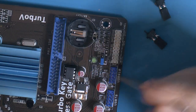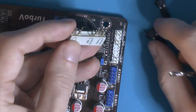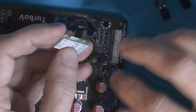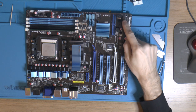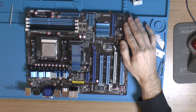It does turn on, so you have a power LED here, so you can turn the power supply on via the motherboard. You can touch the power and ground and it will turn on the power supply and then everything else, but there is absolutely no life on the computer. I have put a postcard in it. What I initially did was troubleshoot this area and trace other things, figuring maybe the problem was here, and I didn't find anything wrong over here.